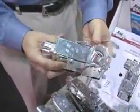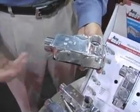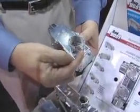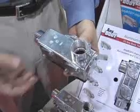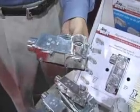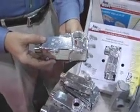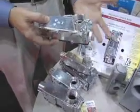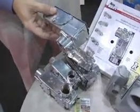Inside there's a third hub, so you can change this from an LB to an LR, to an LL, to a C, or even a T — which is why you have the third hub in there. The hubs themselves have a set screw connector as well as threaded, so it's a combination hub. It will work for both EMT or for IMC or rigid conduit. So if a service electrician had this, it would essentially work for virtually all kinds of conduit and for any situation they'd find themselves in. It puts the power in the hands of the electrician. This one condolet alone replaces over six different configurations, and the covers and gaskets come right along with it, so you can't have the wrong thing on the job site.